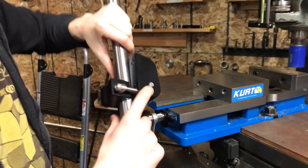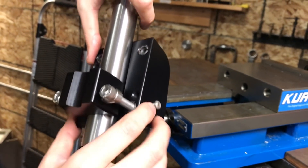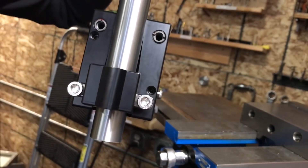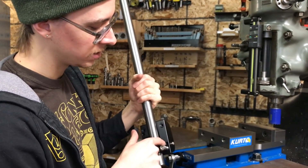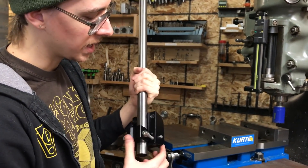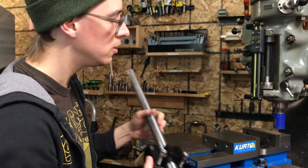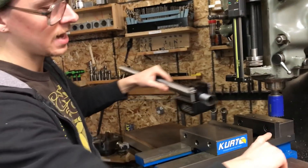Knowing that Kurt-style vices are so popular, I put a three-eighths pin hole in here with a one-inch long dowel pin and a little set screw. All my fasteners are metric because people who work on bikes use metric Allen wrenches more often — M8 screws and an M8 set screw with a four-millimeter head. If you don't have this style of vice, you can remove the pin really easily. But if you do have it, you just set this pin into the head of that screw.